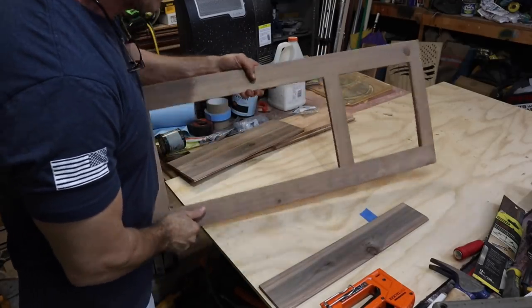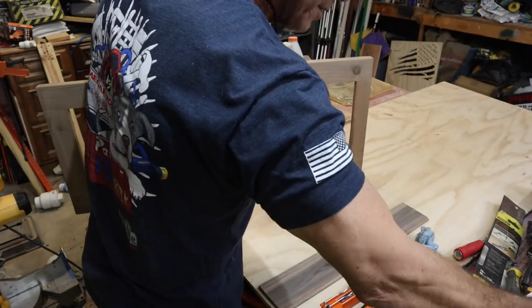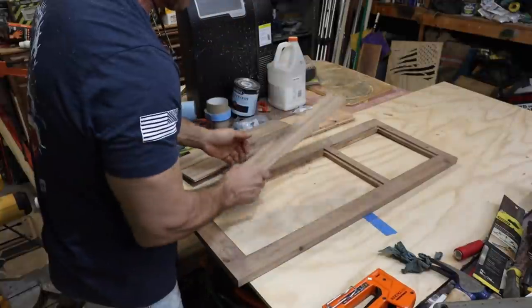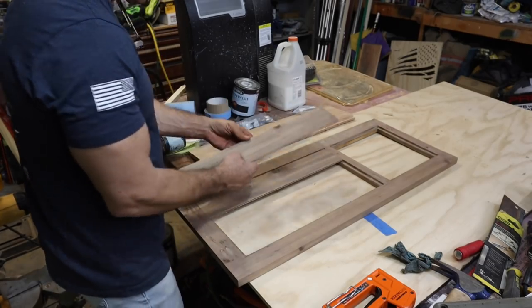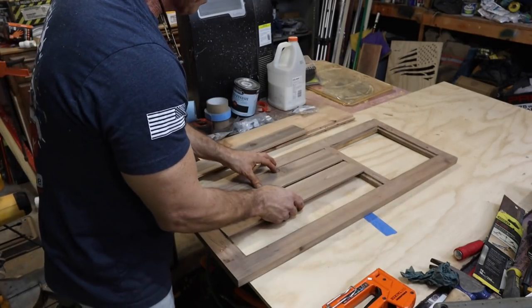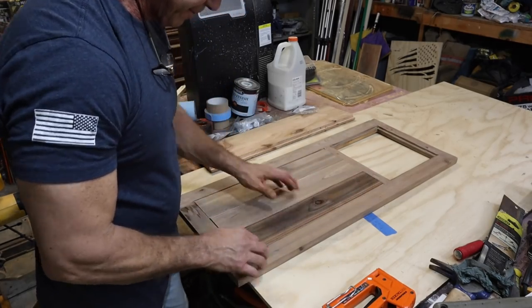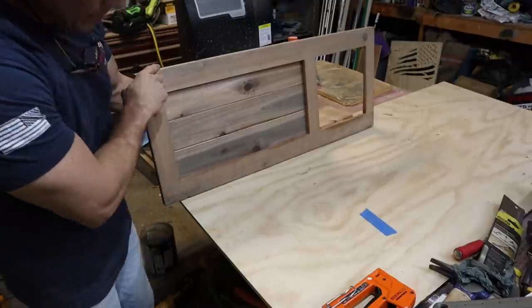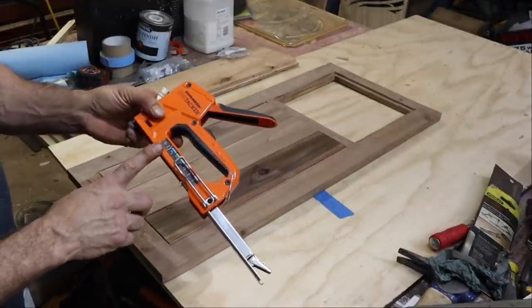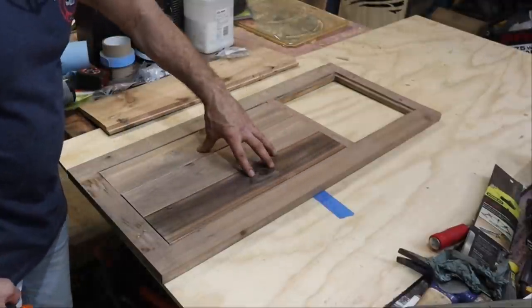It's been about 30 minutes and everything's dry. Oh, I'll need to get a little bit of spray, put it on a rag and wipe this — that'll change colors. I think I'm going to go with this side anyway, make this the back. Oh yeah, I like that. So I'm going to tack it in place. This is my Swanson Unitacker — it shoots six different fasteners, one of them being a nail. This is an 18-gauge nail, so I'm going to tack this in all the way around and it's going to hold the center in.